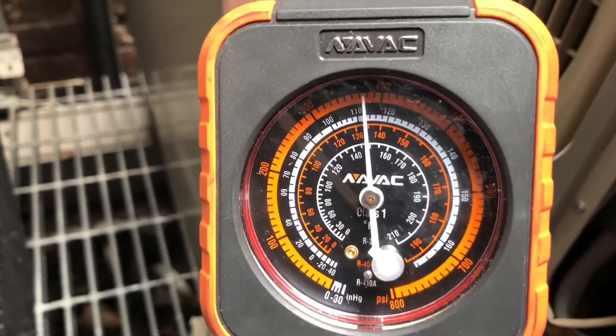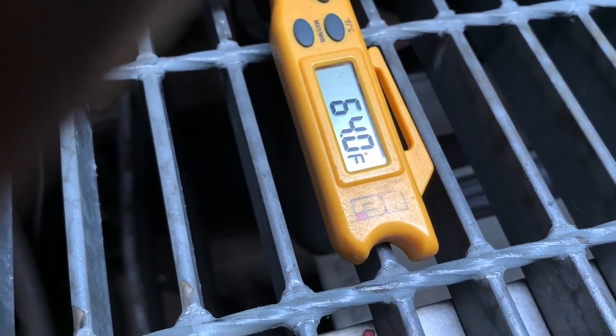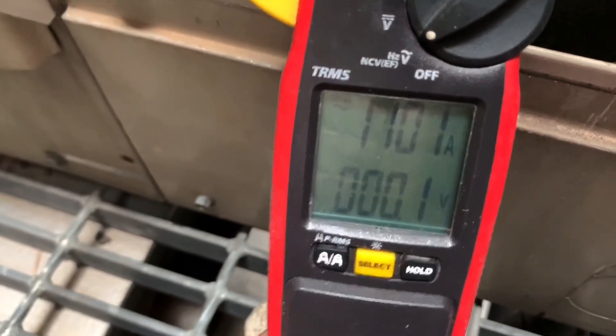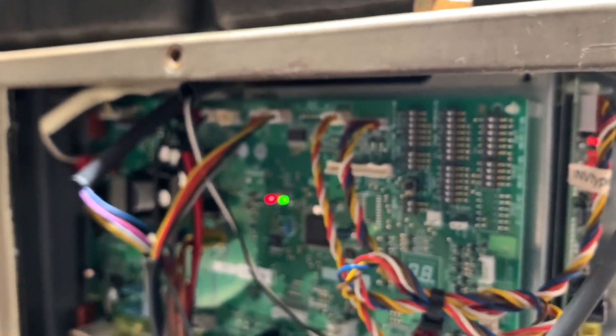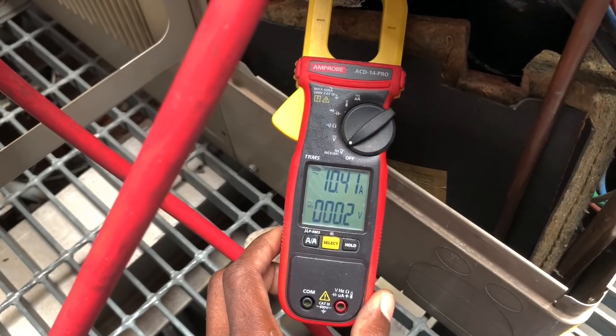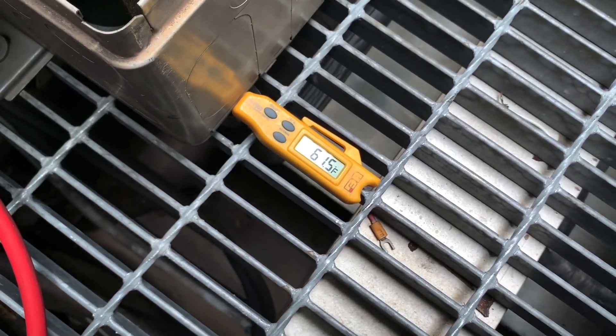Every time without fail it goes up — pressures look good, temperatures look good, amperage looks good — and then it drops. No error codes. This particular unit I believe is the MNet conversion board and I can use my MN converter with my laptop, but I'm not going to do that. I'm just going to configure the dip switches and see if this thing will stay online and run constant. It stays on for a couple of minutes, maybe three or four at the most, then turns off. My suction line temperature is dropping — about one degree — that's my suction line.